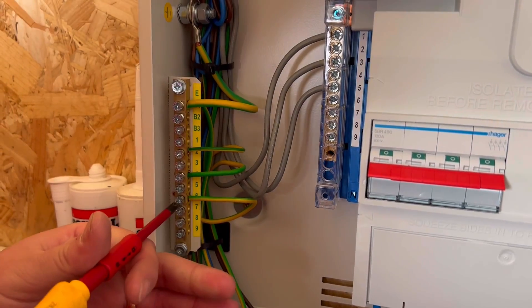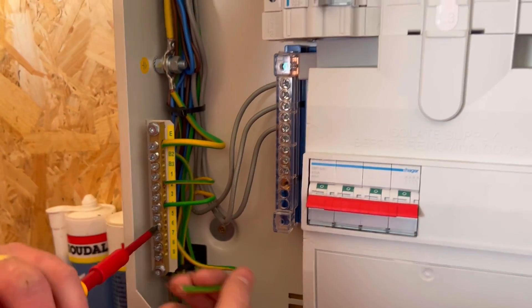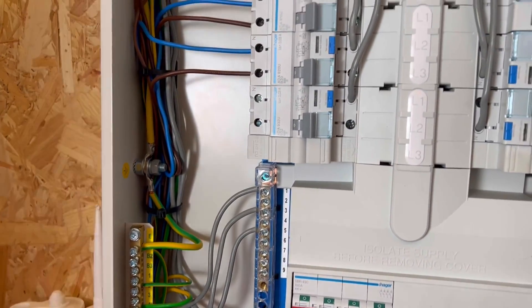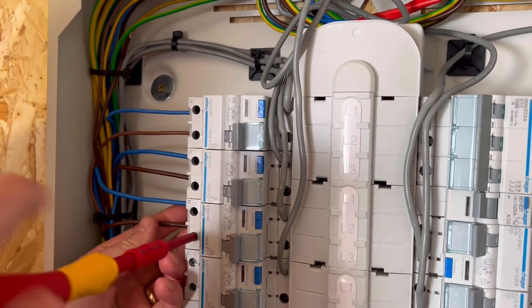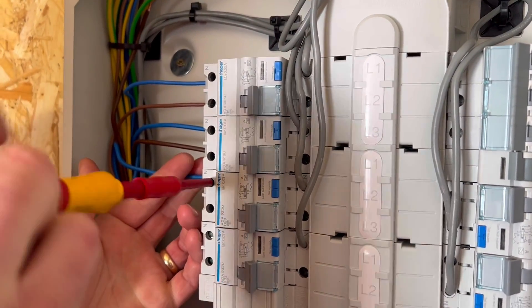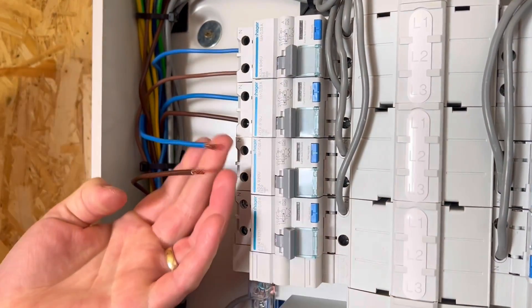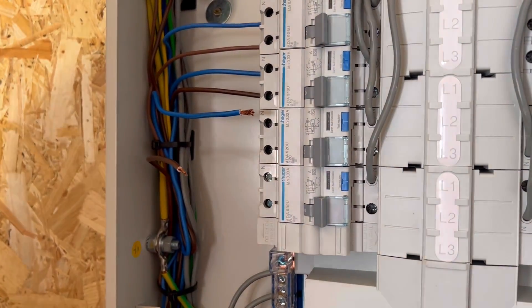In order to carry out the test I'm going to disconnect all of my conductors from the distribution board for that radial socket circuit. I know the on-site guide and Guidance Note 3 often shows a permanent link between the line connection disconnected to the earth bar where your CPC would be connected, but I'm going to disconnect all of mine in order to carry out the continuity of CPC and polarity check on our radial socket circuit.